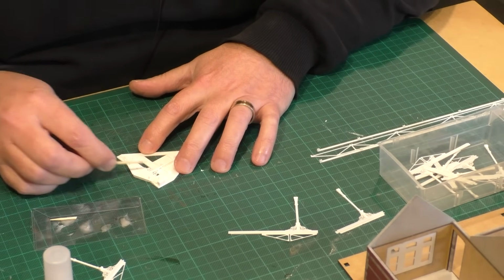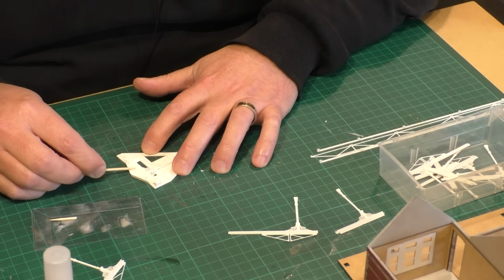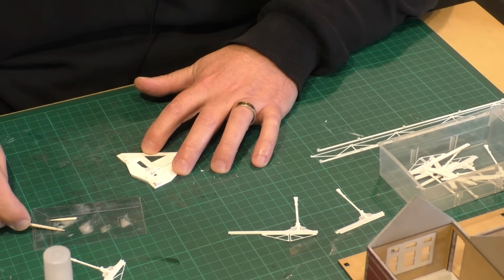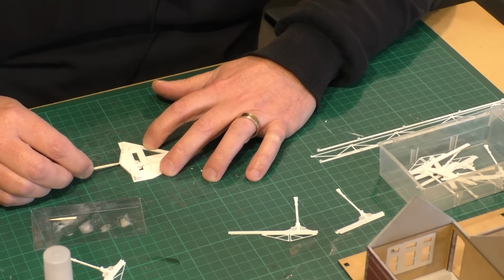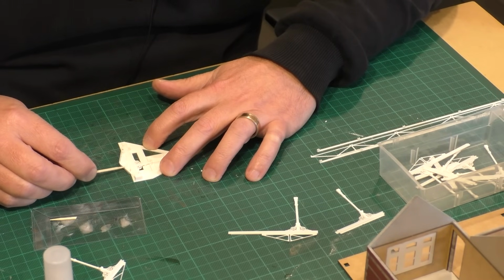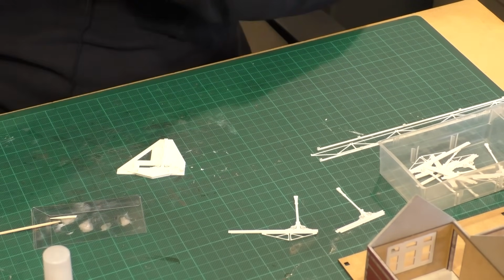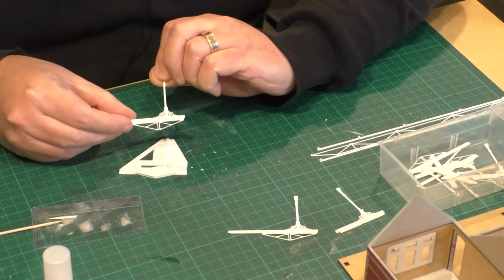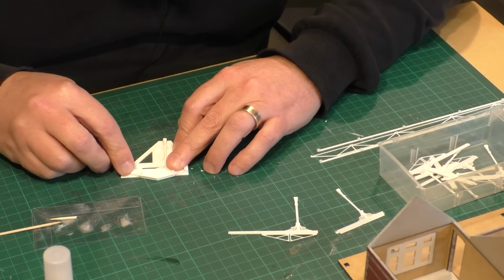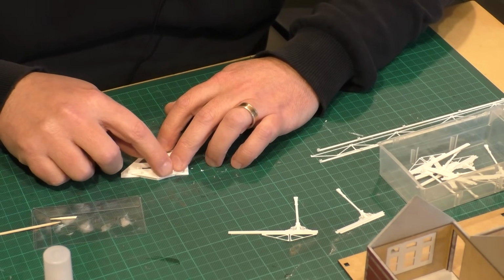I don't worry about this ornate corner support, because I worry that the glue will squeeze out and fill in the cavities. So just a thin bit of glue down these strips here, and it doesn't need to be applied to the entire area, I don't think. It's really just enough to lock it together. So let's apply that glue, and then if we get our other half, and I butt it up against that block at the end, and then just apply a little bit of pressure to lock it in.